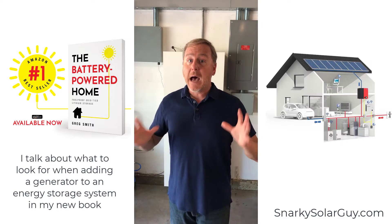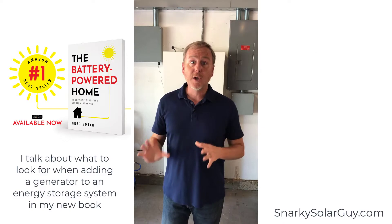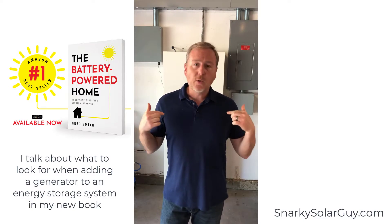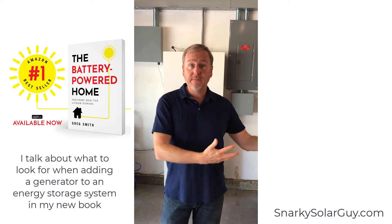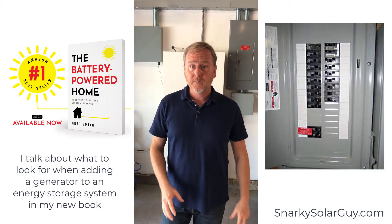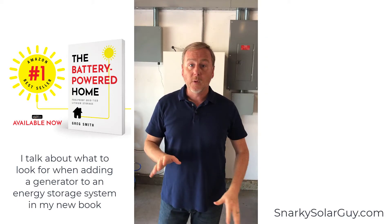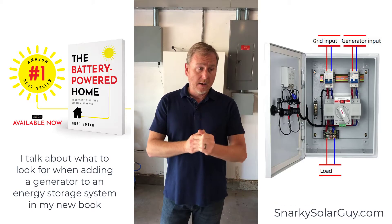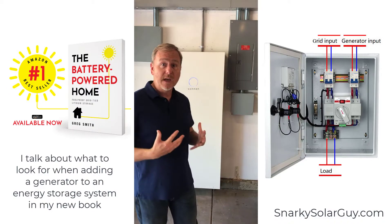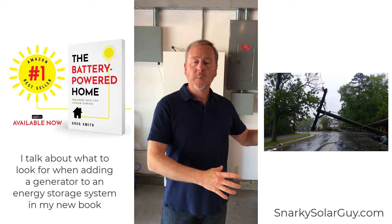Generally speaking, we do not install solar on the load side of a generator — that's a no-no. The reason is because solar inverters are current sources; they create current electrons. If the grid voltage and frequency is good, out go the electrons. And once it hits the breaker in that breaker box, we have really no control over where those electrons go. That's the whole point of having an ATS or some type of isolation in the battery system itself — to cut off the microgrid PV production from making it out to the grid.